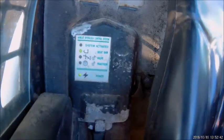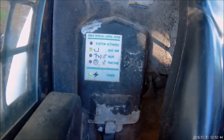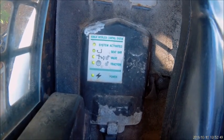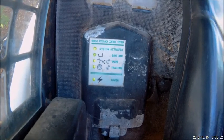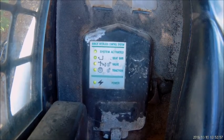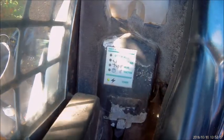With the seat bar down, I turn my key on, I get the light — it goes through its normal thing. Then as soon as I hit the traction lock, they all light up. Valve one is open, so now the machine can run. I couldn't lift it or nothing with the pedals, so I had to bypass it, and I think I got that figured out. As soon as I lift the bar up, that safety kicks in and it shuts off all the lights.